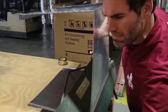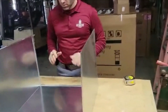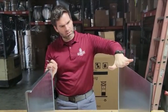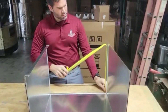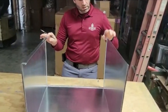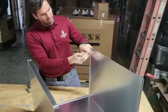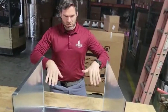Now I can unlock it, pull it out, and what I now have is the front with this piece bent back, I've got my back where my actual bar lock will sit, and I've got my bottom. That's at 17 inches, this is at 16, so this is exactly an inch higher than here, and my bar lock will sit one inch down so my unit will literally sit about right here. Now we'll finish bending our side pieces and put them in the sides to complete our box.